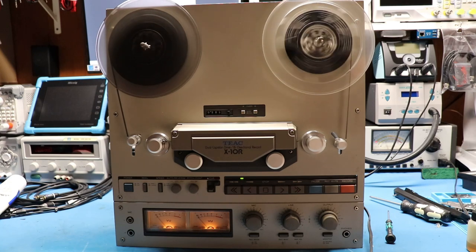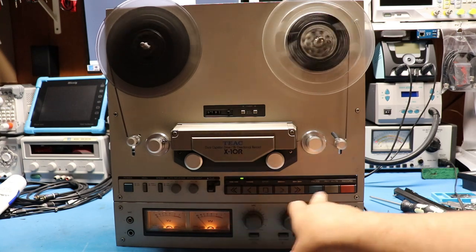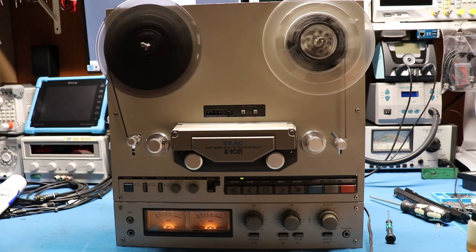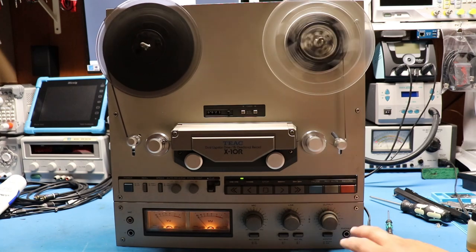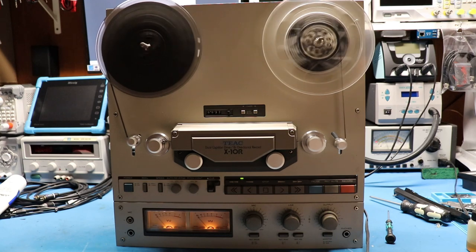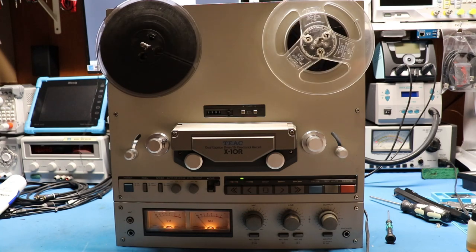This machine is essentially fixed - I just have to do the rest of the cleanup. Someone put pencil marks on the buttons, probably so they could see them better, so I'll clean that up. Also, deox all the switches and contacts, and when deoxing make sure you use fader lube and not contact cleaner, because contact cleaner will mess up the carbon traces on the actual parts. The brakes work really well, so this machine is essentially fixed. I'm going to do the rest of the restoration on it and this concludes the video.